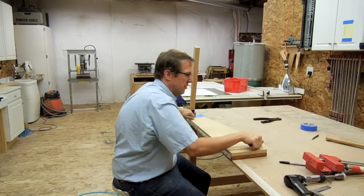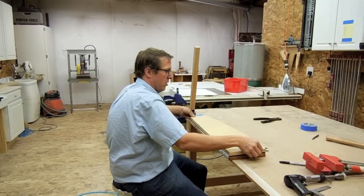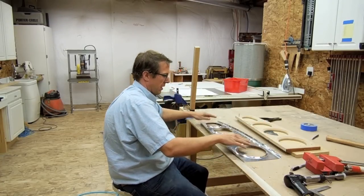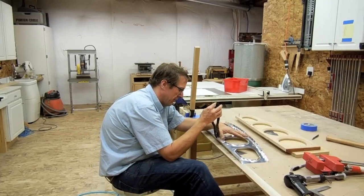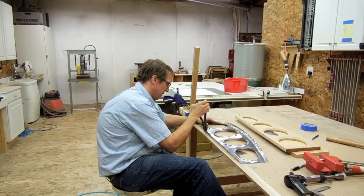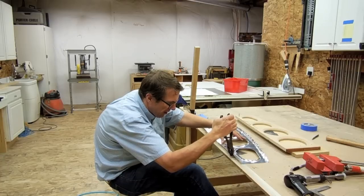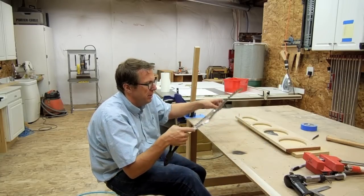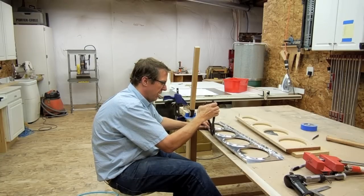Take this out. Take it out of my form. Here. I tend to start with the flat edge first, and I'm going to do this in a couple of passes. So I'm going to start off by fluting it to bring it straight. Getting it fairly close, but on this pass, not perfect, because I'm going to still need to straighten this flange to 90 degrees. It's not 90 because of the spring back of the aluminum. So we'll do this side too, and I'll show you about how I go about getting this flange to 90 degrees.